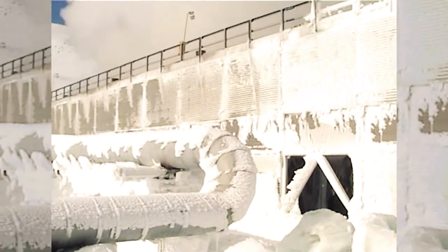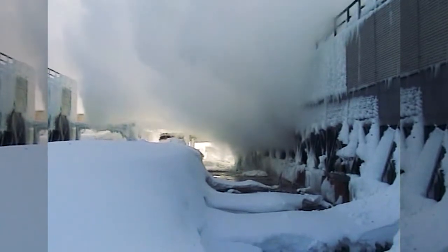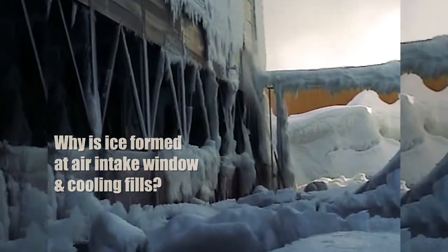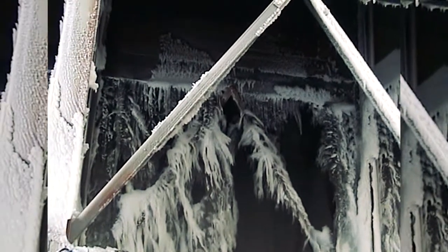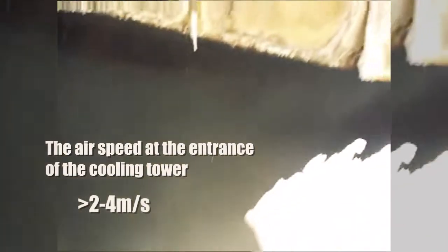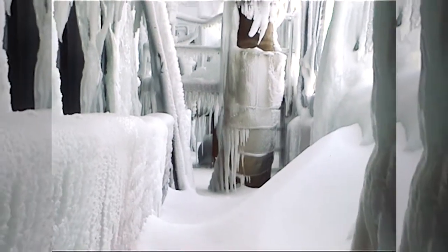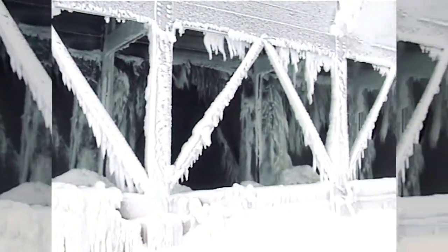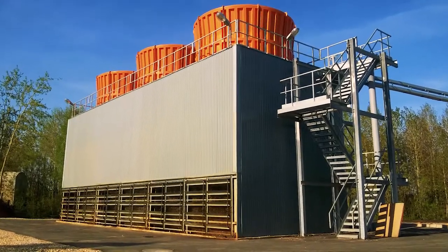In the hot and warm season, cooling towers operate in traditional mode. At below-zero temperatures, icing of the cooling tower occurs quite often. Even without a fan operating, evaporating hot water creates good thrust. The air speed at the entrance of the cooling tower is at least 2–4 meters per second. When outside temperature is below zero, there is intensive cooling of the air intake window louvers and cooling fills. Icing is further intensified by wind and low temperatures.